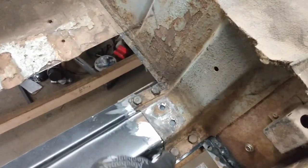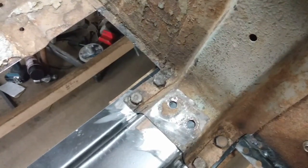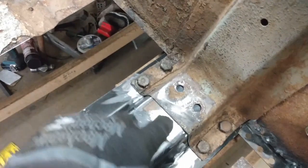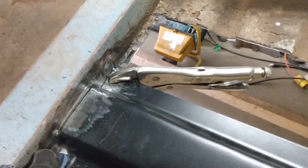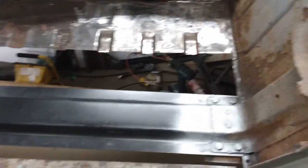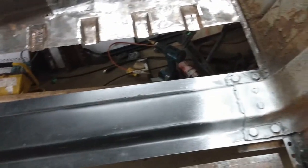Here we are looking from the top side. You can see the four bolts that go through this reinforcing piece here. I've cleaned off the paint on the reinforcing beam so I can do the spot welds, and cleaned up all along here because it gets welded along into here and here through those spot welds. At the other end it gets welded up to this bulkhead where I put in that patch — I still have some to finish welding, but I can do that all at the same time. It's a lot easier to do from on top. There we have the reinforcing beam welded in and it's good and solid. So I'm going to flip the car back over and start to work on getting the floor pan itself back in.